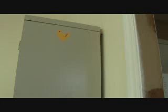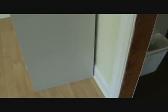And I put a block back in there and mounted it to the wall. So I just made that gap the same. I checked it with a level too, and it came out pretty good, because you still want to have your cabinet fitting tight to the floor, even if it's not perfectly plumb, straight up and down, because you don't want to get one side off the ground. So I did really good on that. I checked it all, and you've got to find the studs up there.